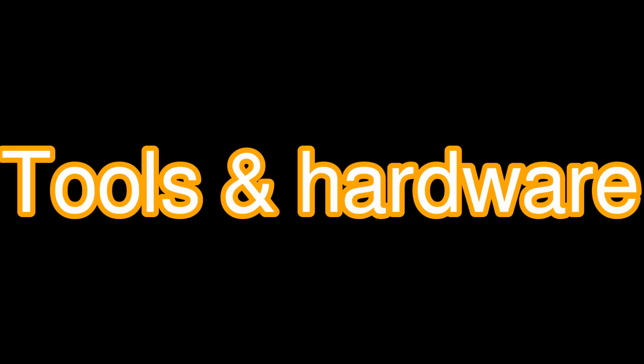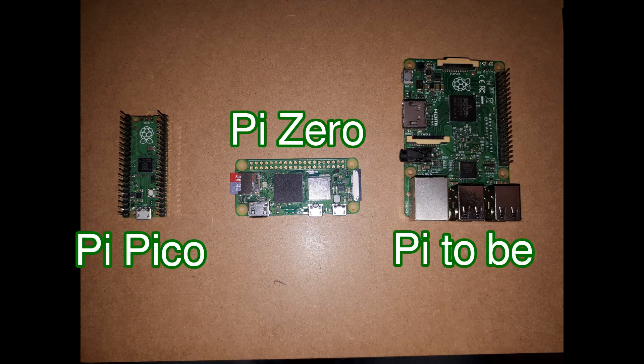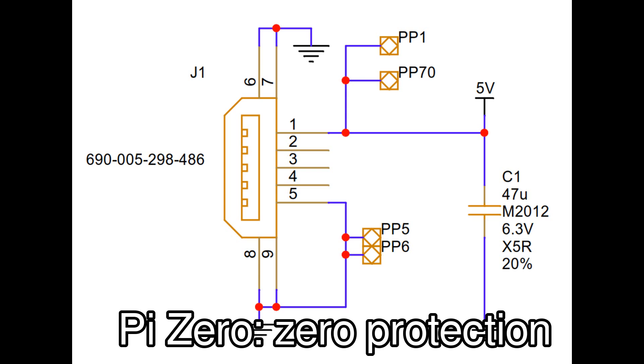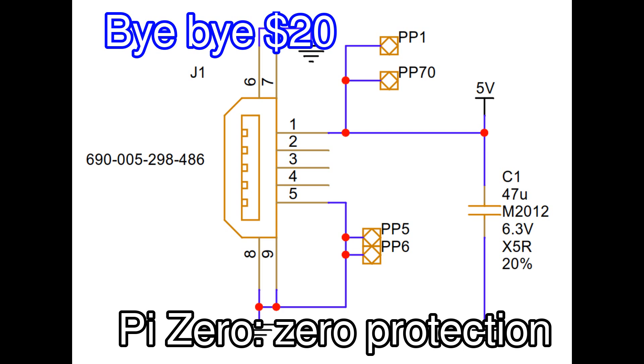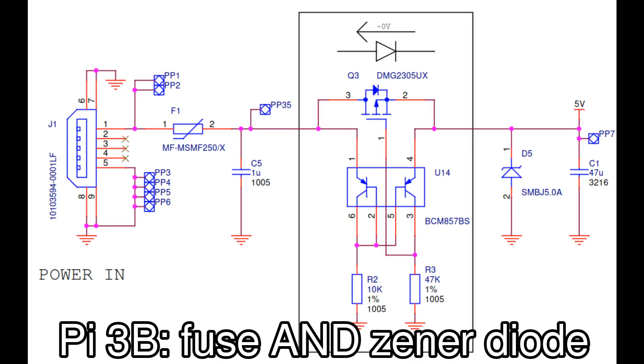Tools and hardware: I used a Raspberry Pi Zero 2W, the cheapest in-stock board I could find. A Pico W would also work, but it's just so much easier and fun to use a full Linux machine. Note: the Raspberry Pi Zero product line doesn't have a protective fuse, so make sure to give it 5V only. I fried a Pi Zero by plugging it into a fast-charging phone charger that can go to 12V, so I've stuck to regular 5V chargers ever since.